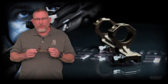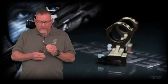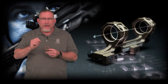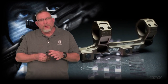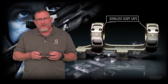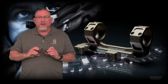When it's machined from one single block of aluminum, this is totally integral. We don't have separate pieces that are screwed together or glued together — it's one piece. The caps start out as a solid. We line bore through both caps with a boring bar so they are exactly in line, exactly sized to your scope's diameter, and exactly in line with your mounting surfaces where it mounts up to your upper receiver. These caps are then split with a jeweler saw, and each cap is serialized to the base so that when you put them back together, each one is exactly in its appropriate position, maintaining the best possible precision alignment to your Picatinny.